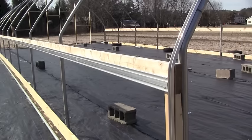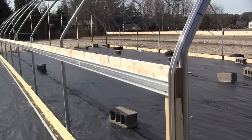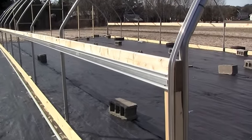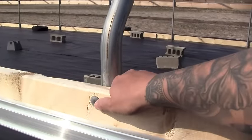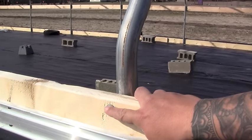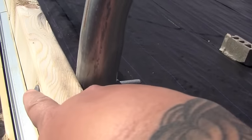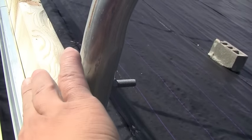The next thing we put up was the hip board — these are two-by-sixes, bought at 16 feet, about three of them, and we had to cut a little extra for the very end. Same wood, two-by-six, for the baseboard as well. We used carriage bolts to secure it. You definitely want to make sure the bolt heads are nice and flat — if anything protrudes too much, just use duct tape so the plastic doesn't snag. I drilled with a metal drill bit first to make the hole, then pushed the bolt through and hammered it in to get it as flush as possible.